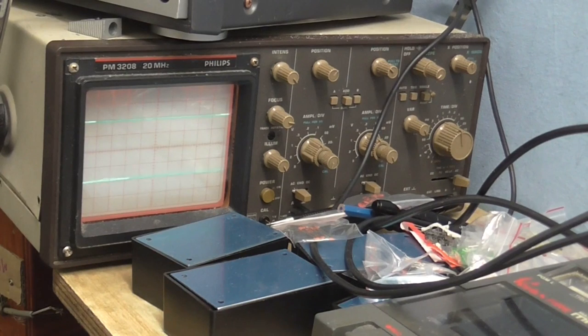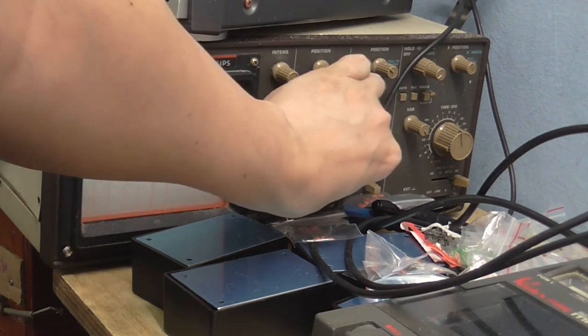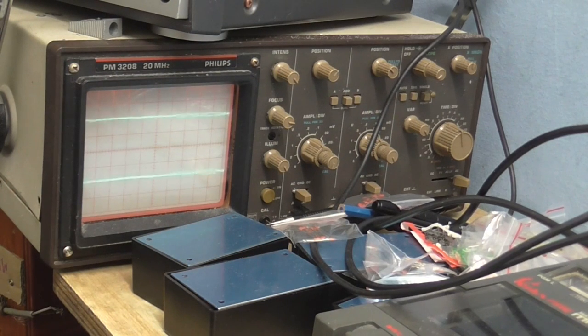Let's see if we've got any waveforms. I'm going to pick up the microphone, and testing, 1, 2, 3. Okay, for some reason, the bottom waveform's looking good, but I'm barely getting any top waveform, unless that's just a loose connection on my scope leads. On my scope itself. Okay, yeah. Just got a little bit of a scratchy connection on my scope there. But we've got opposing waveforms, even though you can barely see it. And that's exactly what we want.